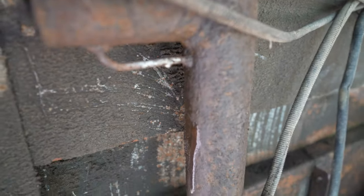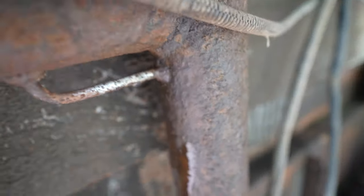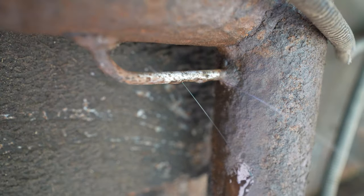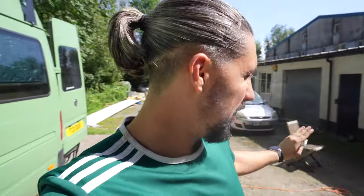Whoa - there's two leaks! Can you see them? I've just been into the workshop and I found this metal weld - it's called JB Weld. It's got steel and a hardener with it, so I've just applied some of that to the ram. It takes four to six hours to set, so I'll have to leave that to cure overnight, try it in the morning, and then if we still have any leaks I'll have to apply some more again, just keep building it up layer by layer until we are leak proof.